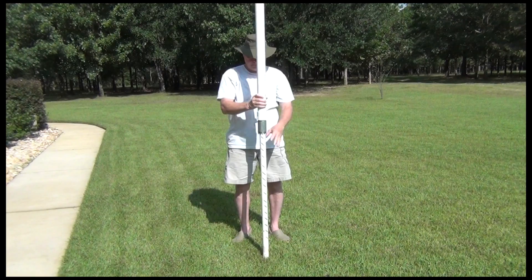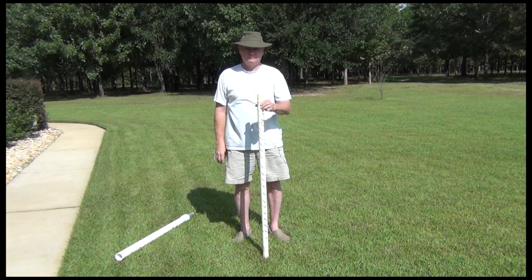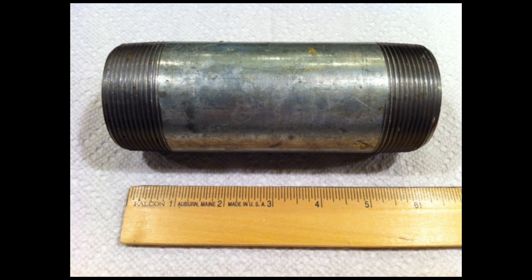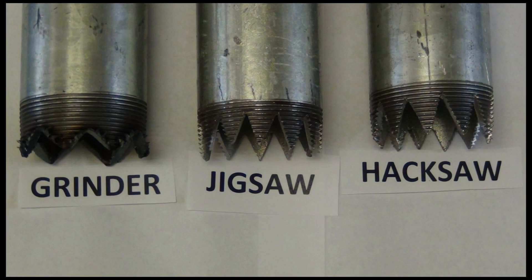Accordingly, it is important that the drill bit be hollow, so at the end of the drilling process a well screen can be placed through it. We start with a 2-inch pipe nipple — this particular one is 6 inches long, but any length from 4 to 8 inches is fine. These are the finished versions of the drill bits that we will be making.